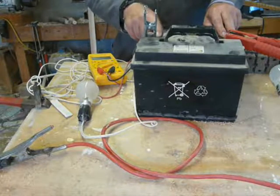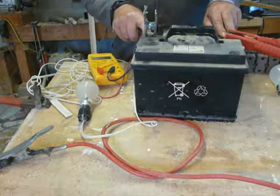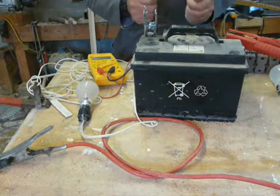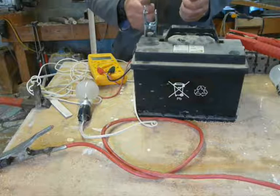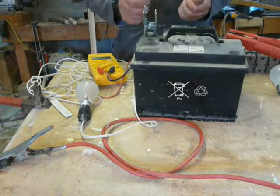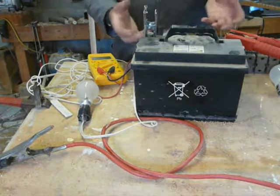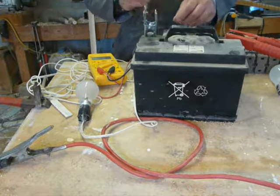The circuit for the charge controller — you can build it yourself — the circuit and instructions are in Edition Two of Wind and Solar. We've used this circuit for years. Basically it's a comparator and a timer. You set the comparator so that once you're above or below a set voltage it switches on, and then the timer lets you preset — for example, stay on for five minutes then switch off. If the voltage is still high it switches back on; if not, it doesn't. It's easy — just 20 or 30 components, a couple of chips in sockets.